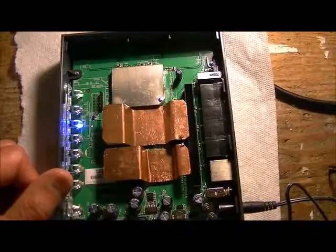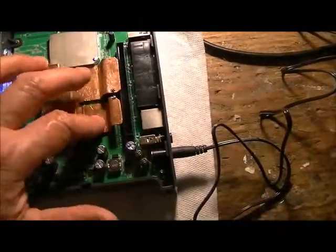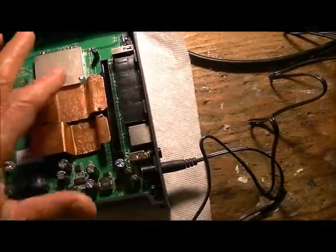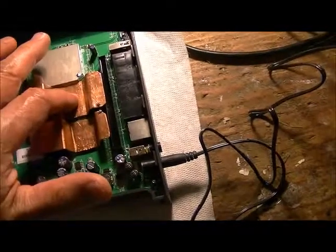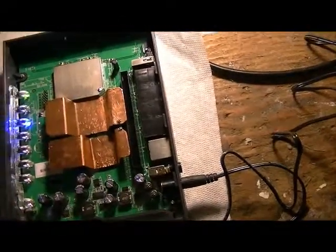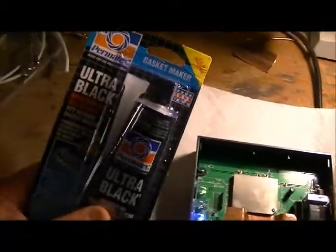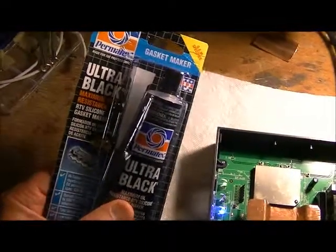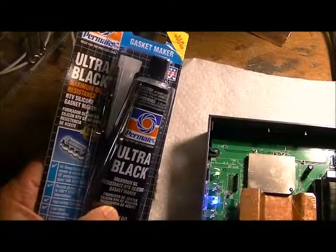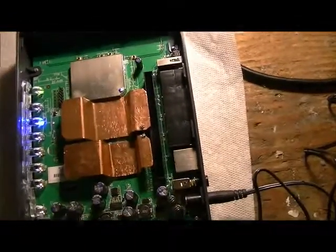In order to do this modification, before mounting the heat sink I have to make sure it's flat — I file it with a flat file to make sure it's absolutely flat against the surface of the chip, to ensure it dissipates heat well. This is what I use to glue it on: it's high-temperature silicone rubber meant for automobile use on radiators, so it can take the heat.